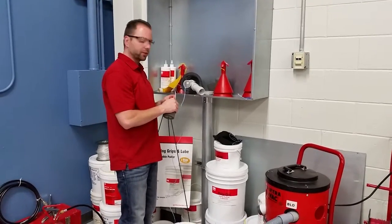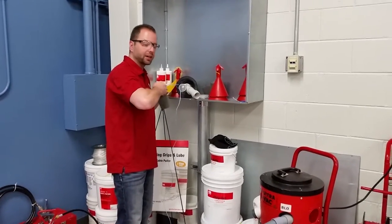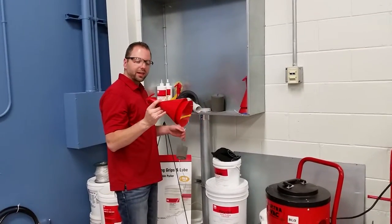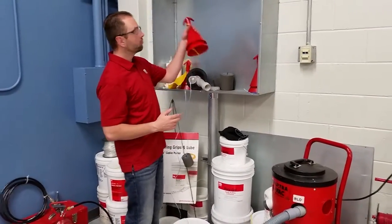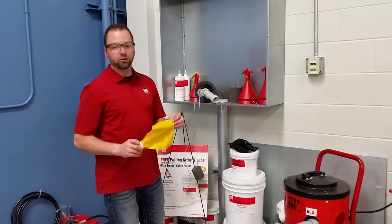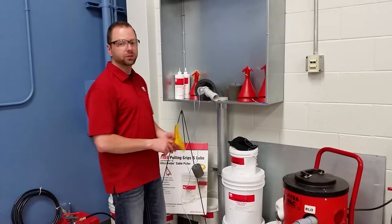There's a little bit of a difference between the three. For a foam line carrier, you generally use that to clear debris out of the conduit. The missile line carrier you use if the conduit already has cable running through it, because the edges are feathered — it makes it easier to move past things like wire that's previously installed. And then you have the balloon line carrier that you use in case the conduit is fresh; you know there's nothing in there, and this just carries it all the way through without any hiccups.